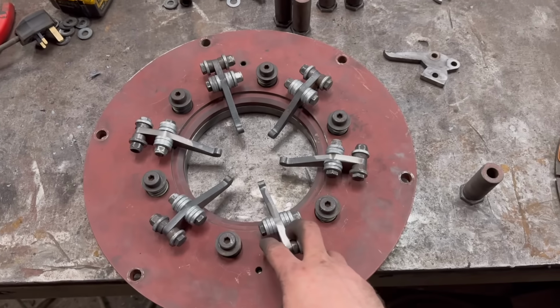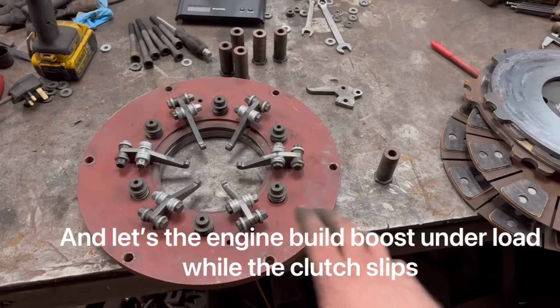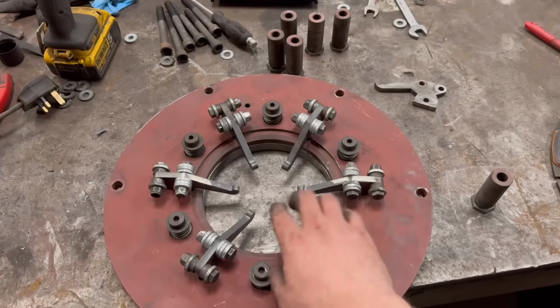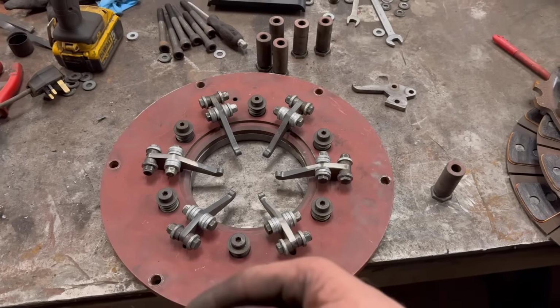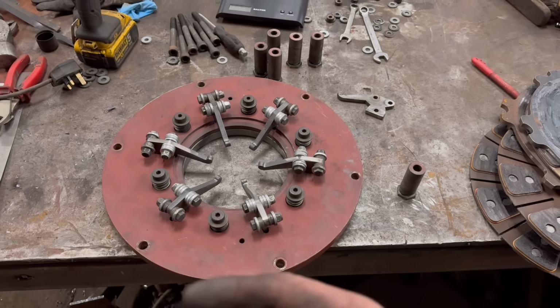They'll take a bit of setting up, but I think we should be right with them weights on. So the idea with these is it sort of loads your gearbox up gradually, and you can run more power through them as well. But these work sort of opposite way to a normal clutch. So your pedal is in theory down all the time, and then as you rev it up, it pushes the clutch pedal back up at you.